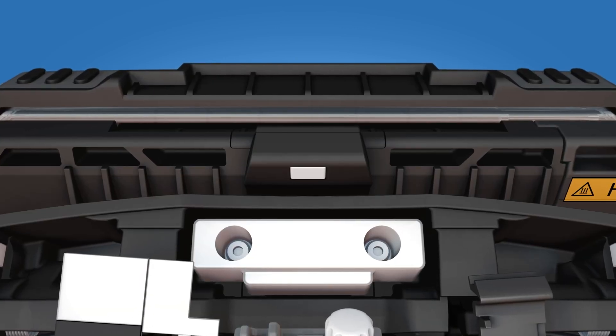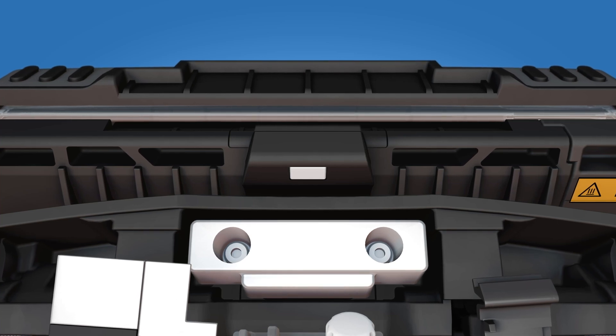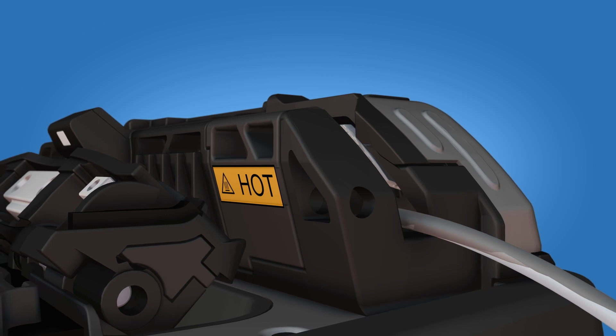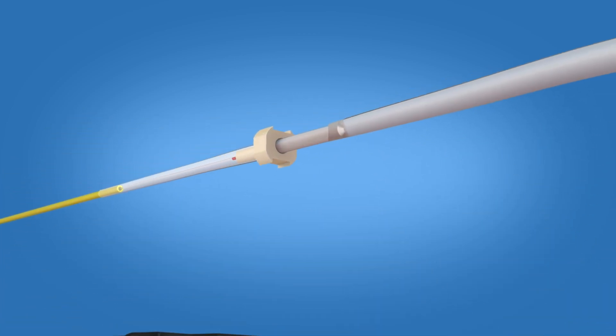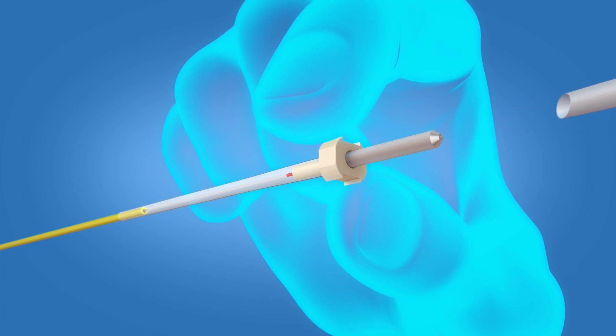Position the sleeve in the center of the heater while continuing to maintain contact with the ferrule. Heat the protective sleeve. After allowing one minute for the sleeve to cool, remove the assembly from the heater. Hold the base of the ferrule unit and remove the transfer tubing.